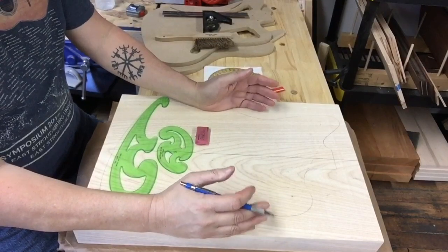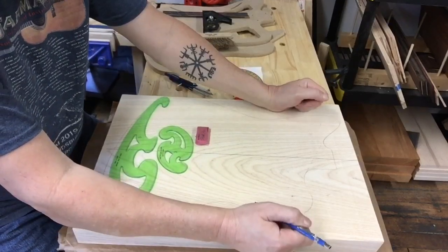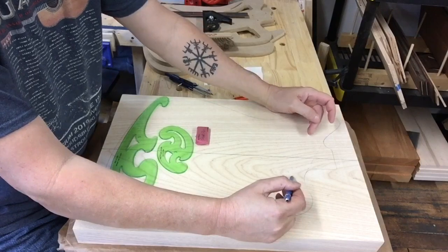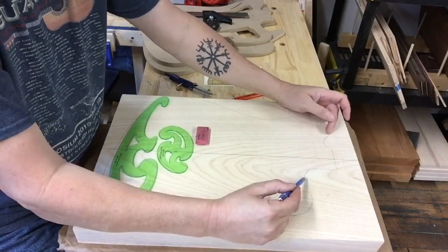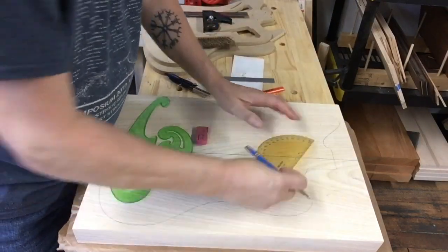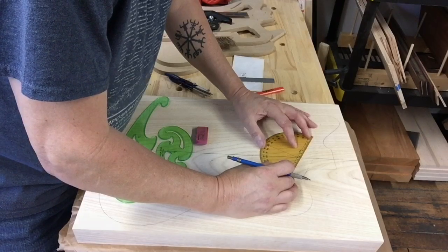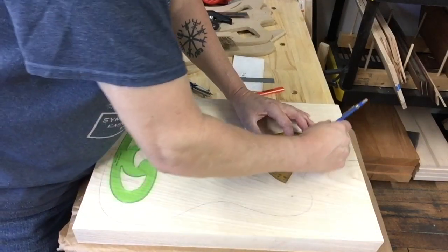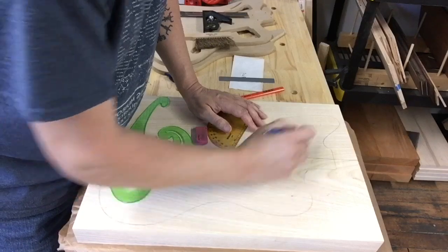So what I'm thinking here is to make the Jazzmaster a little bit more metal. And nothing says metal more than a couple of horns up at the upper bouts. So I think what I'm going to do is take this line and drop that down. I'm also going to drop down the neck joint. Carry this angle back down maybe an inch, and that's where I'll get my horns from. So there we are, there's our inch. There's our 62 degree angle. And there is our new profile. So I'm going to go ahead and use that to make the horns.